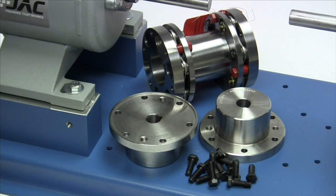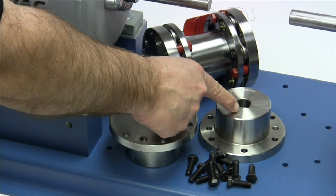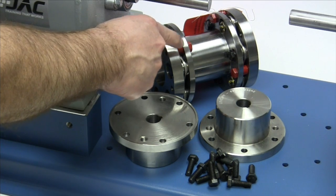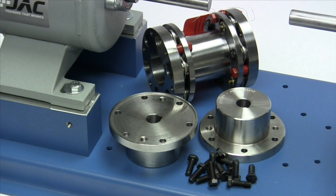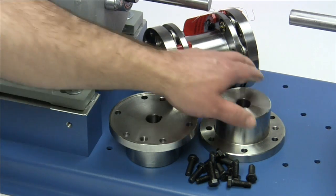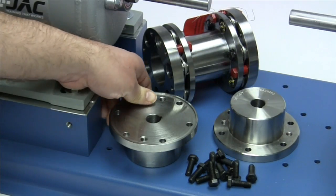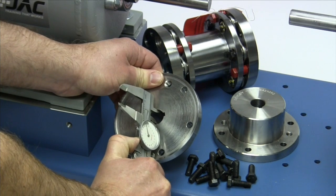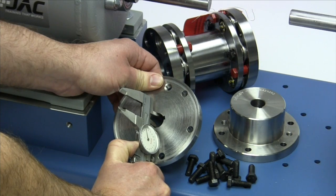The following components are provided with the purchase of your Lovejoy DI-style disc coupling: two DI-style hubs, a DI drop-in spacer assembly, and hub mounting bolts to connect the hubs to the spacer assembly. Prior to installing this coupling, you should inspect each component to ensure there are no visible defects, cracks, or damage from shipping, and check the bore size for accuracy. By default, Lovejoy supplies disc coupling hubs with an interference fit, and you may notice the hubs are bored slightly smaller than the equipment shaft diameters.